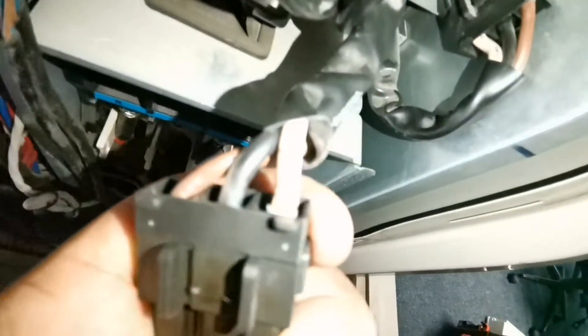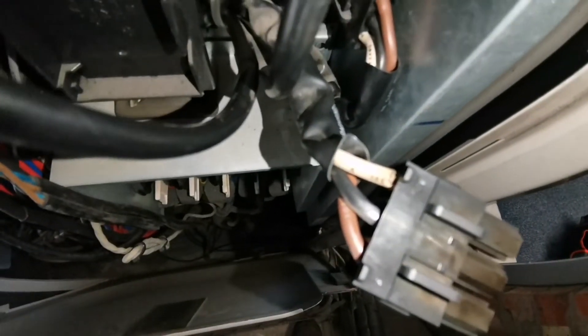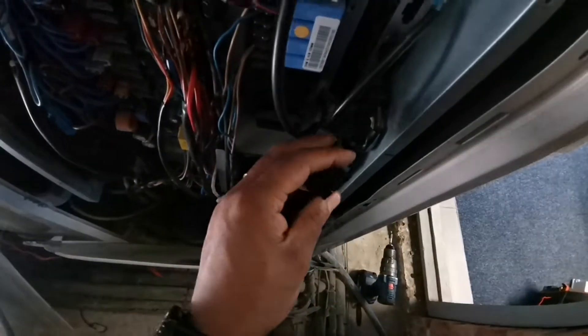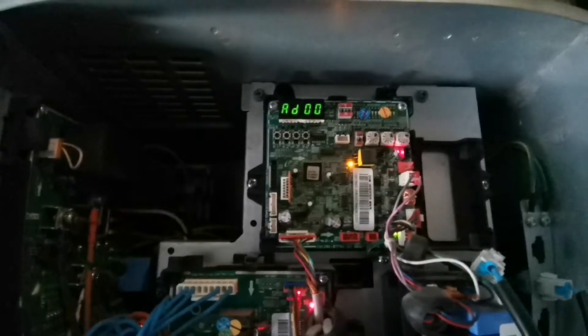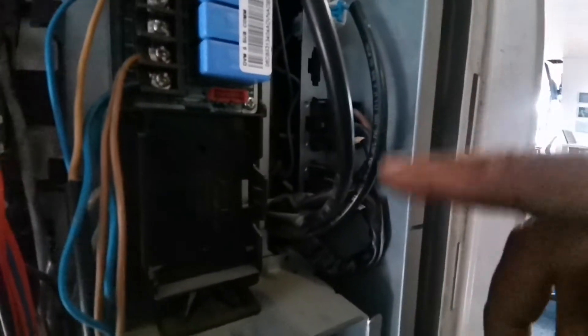You can see that the cable is actually starting to burn through the insulation. Let me take the flash off - maybe you'll be able to see better. Look at that. So let's see what we can do to get them running for today. Look at that - all of our lights are on and our main board is on as well. These connectors will have to be recommended for replacement for sure.